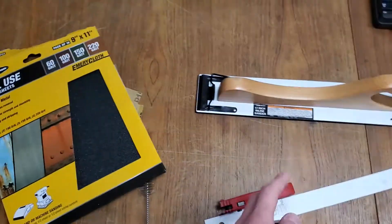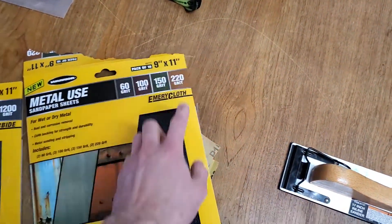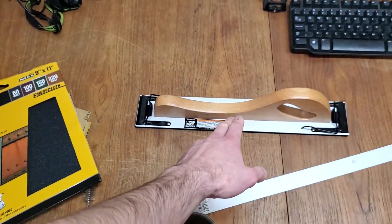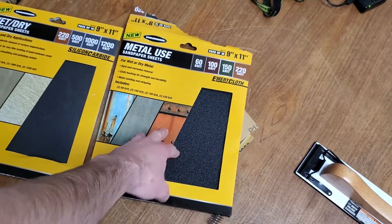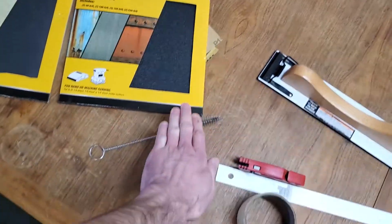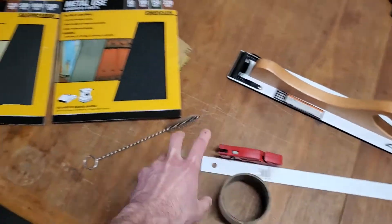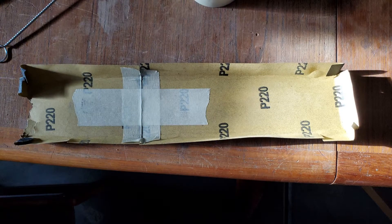As you can probably do simple math, the sander is 17-inch and the paper is 9 by 11 — these are not the correct size, because I could not find the correct sanding cartridges for this. What I did is I took each sheet and cut them in half straight down the long way, then stacked them — one on top, one below. Then I used some painter's tape and linked them together: one piece across the cut, and one straight down.